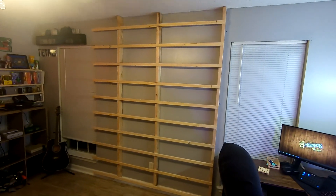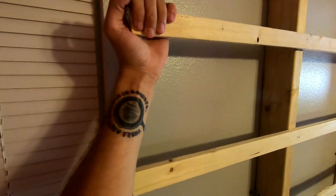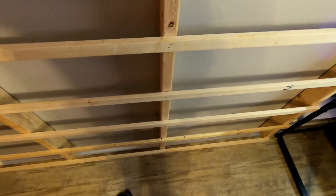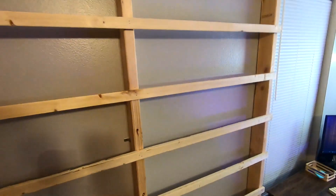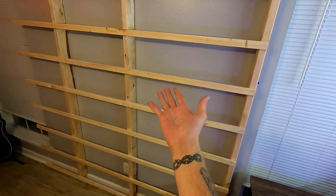We're back from cutting all the lumber. I had Shelby mark while I was cutting — we make a great team. I've already put one board on just to pull the two-by-fours together while I work. I'm going to start at the bottom and go up. This piece is exactly eight inches so I'll put one on the bottom, mark it, and keep doing that all the way up to keep me straight. Are you ready for the big reveal? Bam — brand new shelves.